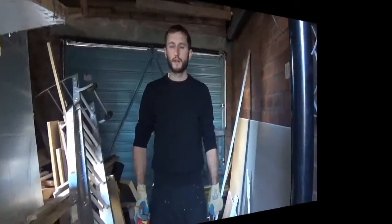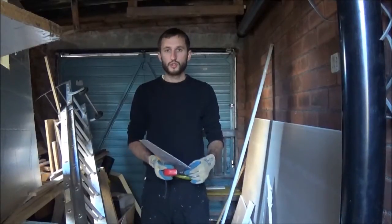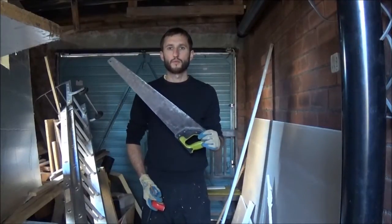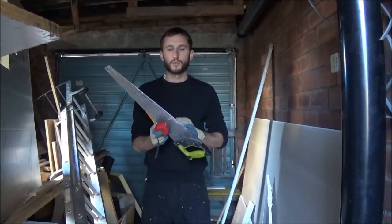In this video, I'm going to demonstrate to you how to cut plasterboard. The tools you're going to need for this job are a saw, and don't use your best wood saw because cutting plasterboard will blunt the blades. So try and keep the same saw every time you use plasterboard and you'll be fine.